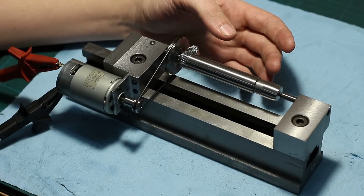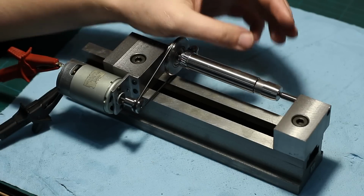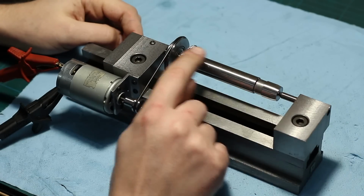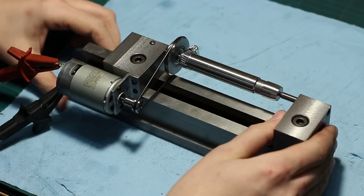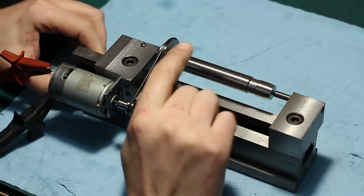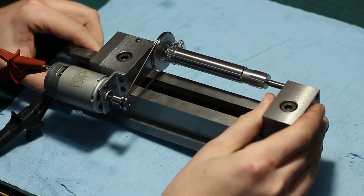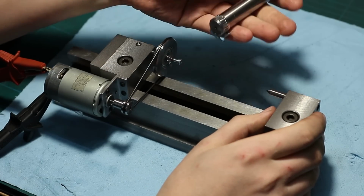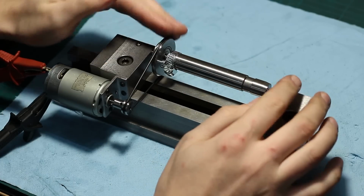Let's turn this off. I use a known good taper like a Morse taper 2 drill chuck adapter, and put that between centers. Then I run an indicator along the top surface of the Morse taper, and I tilt the whole attachment in the vise until I don't get a reading, or a 0 reading, on top of the Morse taper, and then I'm on the right angle. Then I can take out the master Morse taper, put in my workpiece, and do my grinding.